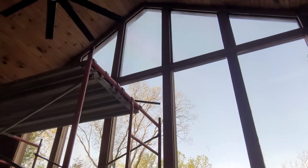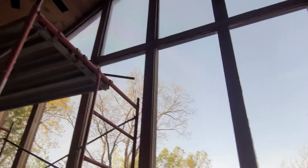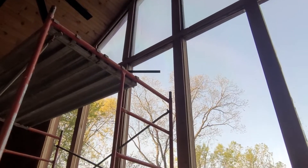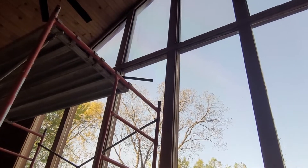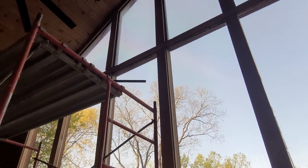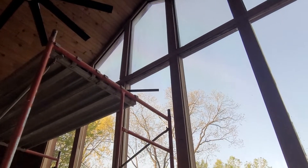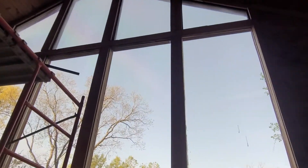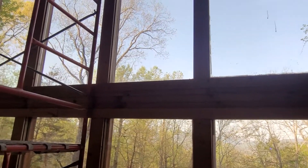This wall is kind of really wavy when it's windy. So today I'm going to pull off all the trim boards and all that wood. I got some straps to lag in there, and instead of having this board right here be two pieces, I'm going to have it be one piece and sink some bigger screws into it — hopefully that stiffens it up. I got straps for all four of those connections and all four of these connections, so hopefully that'll stiffen it up and make it not so sketchy.